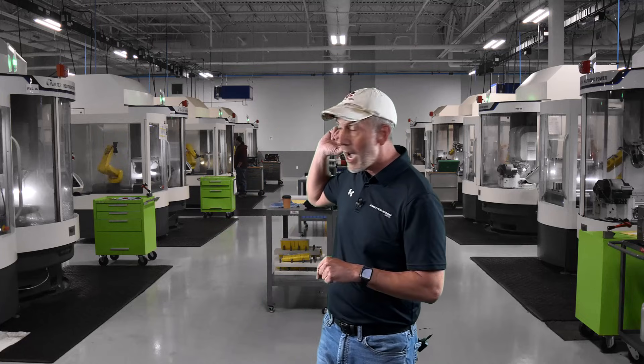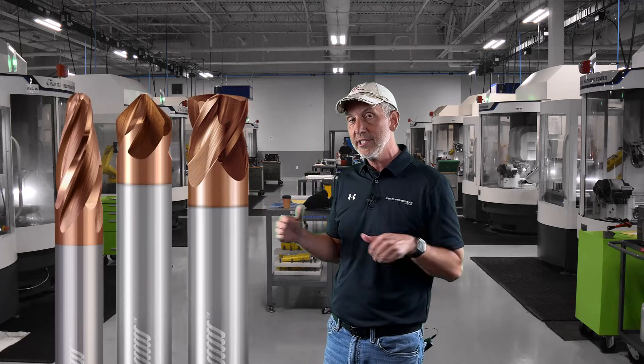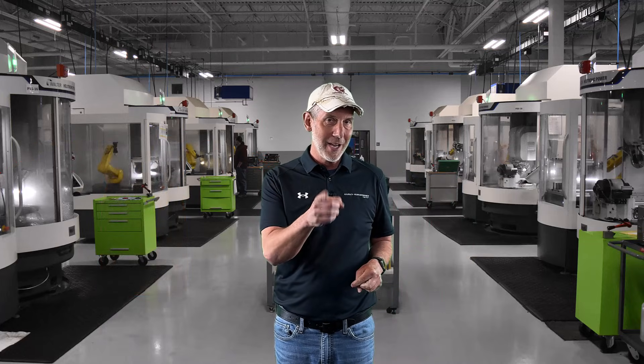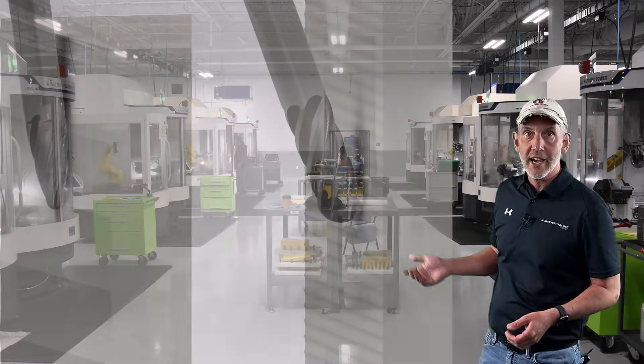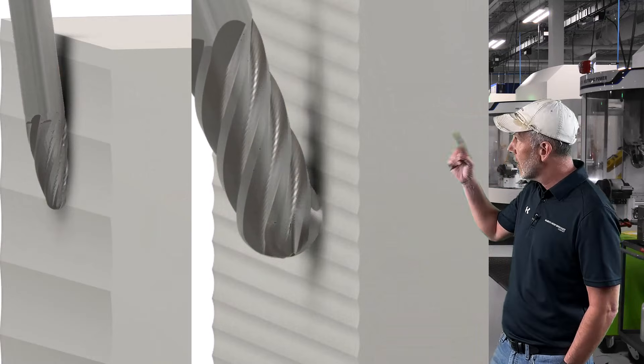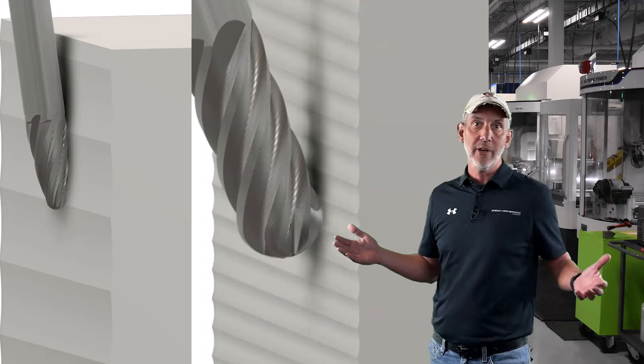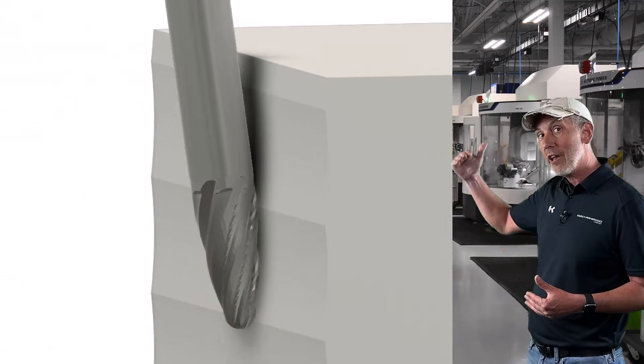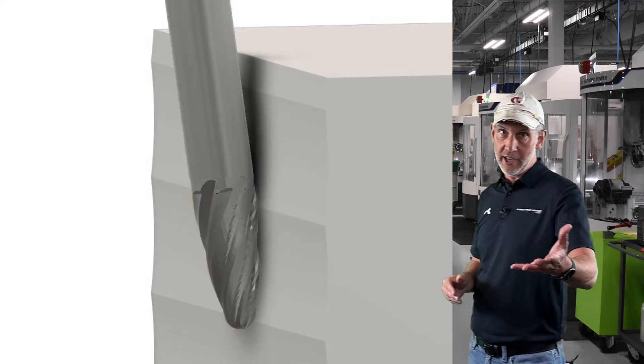There are ways to use that segment. Now that I've got 36 inches of a radius on there, how I can use that is going to benefit me at my spindle when I'm doing surfacing. This is pretty obvious because we're going from a smaller-diameter ball nose to a larger radius. If we put these side by side, you can see if we just use a ball nose and start cutting those scallops, to get a better finish you can go a lot quicker, a lot further down. If you look at a 36-inch diameter — and they start at three, four, or five inches and go all the way up to sometimes 50 inches in diameter.